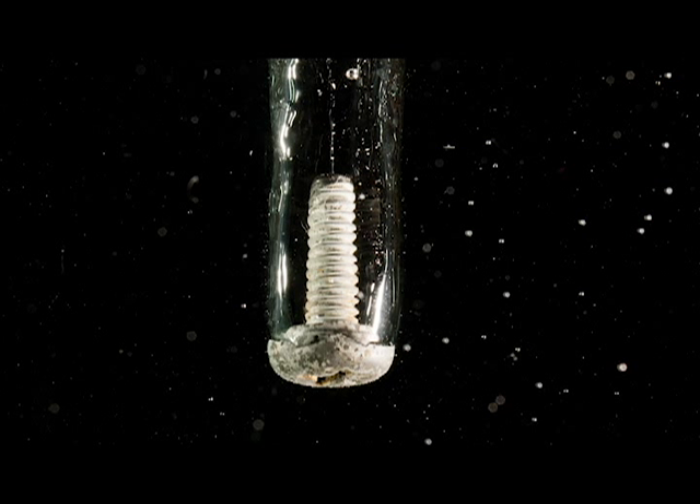This one happened way too quickly because the metal's thin. This is an example of a control test — this bolt here isn't hot, I dropped it in cold. But it is hitting the water at speed. Because it's cold, it doesn't have that protective barrier around it, and the water has immediately come into contact with and sort of bonded to the head there. You can still see a trail of air because the head of the bolt is pushing the water out of the way, but it doesn't have that full barrier because it wasn't hot when I dropped it in the water.